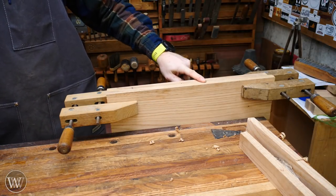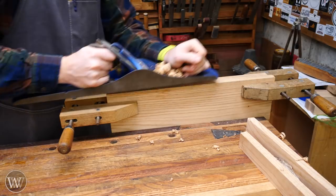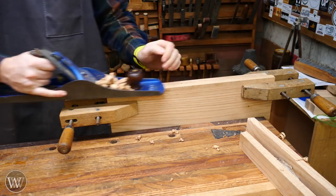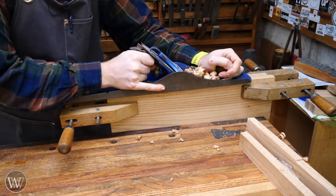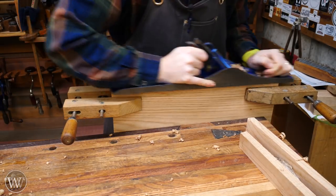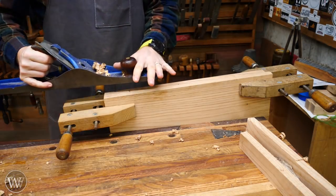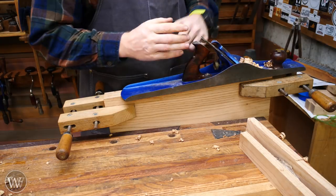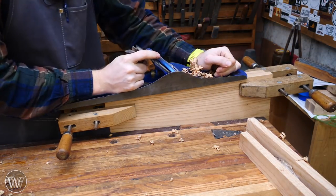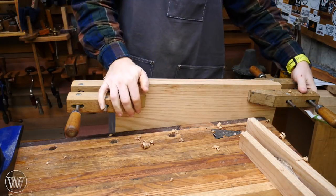Now I've got a nice surface all the way across here, perfectly smooth. I haven't touched the ends — I want to belly out this middle until I'm not getting any more cutting. Basically right now the plane is resting on this end and this end, and the blade isn't making any contact in the middle. Now I can come all the way back and take one good shaving from one end to the other. See how it's tipping? That's an indication that I'm putting too much pressure on the end. When you're starting into the cut, you want your pressure here; when you're ending your cut, you want your pressure back here. Putting too much pressure at the end might round over that edge. So right about here I'm changing pressure — I may even let go, just guiding it with the knob.